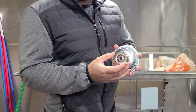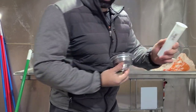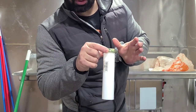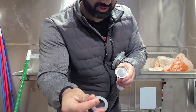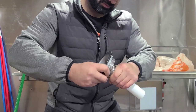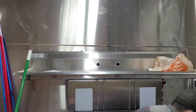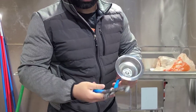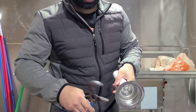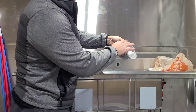We're going to unscrew the bottom, which allows us to put the PVC strainer on there. We put it right in the hole, take the little gasket that comes with it, put it right on top, and screw it back in. Then we give it a twist and get our trusty channel locks, open them as wide as we can, and tighten it up pretty tight.